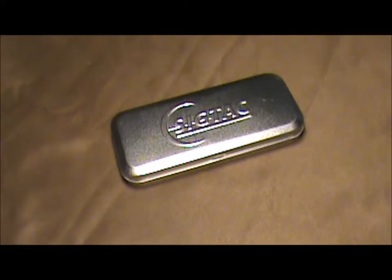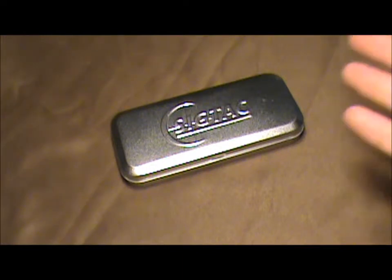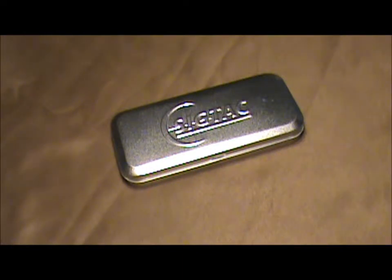The desert is a horrible environment for any kind of machinery, any kind of tools whatsoever, but a Dremel, it's basically one big spinning moving part. So heat combined with sand, combined with the dust from the G10 and everything, I was just not having a very good time with the Dremel. I guess there's a thermal cutoff switch inside the Dremel that turns it off when it gets too hot. And it was exceptionally hot and humid last night.